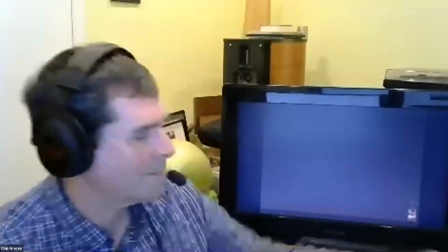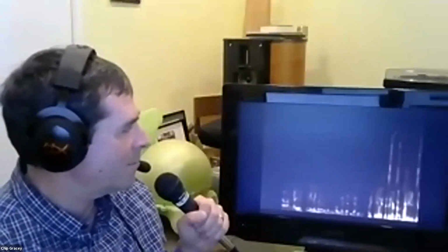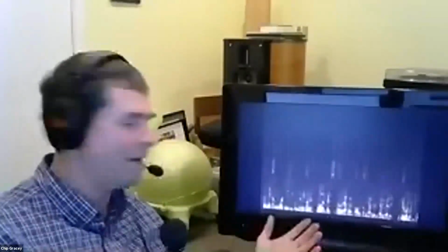Oh, awesome. Yeah, this thing should be a dream for anyone doing motion control where you've got to set up feedback loops. And if you look at this thing here, I'm talking and you can see it responding, right? This is so simple that there's nothing going on here. There's no operating system. There's no heat management. There's no garbage collection. Everything that normally stalls real-time processes on a big machine doesn't exist in this because there's just no need for it. So when you make something that works, it just keeps working that way. It's not going to blow up because some other app got installed or something happened or it's just having a bad day. It's going to run like you'd want it to.